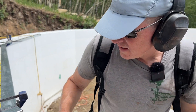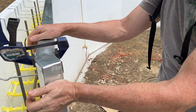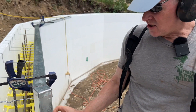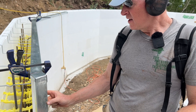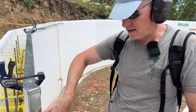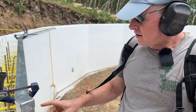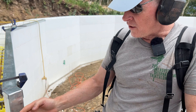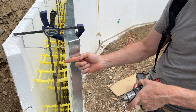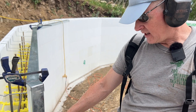Normally you would put a screw with a cap on it to put pressure on it, but I thought it would be more stout to put the screw in directly. It's such a narrow piece of foam and it's not braced very well, so it's better to have this in there. Where the two-by-eight is going to go, I don't want to screw just through foam and into the two-by-six. We've got plenty of this material.